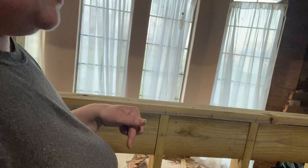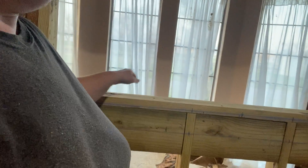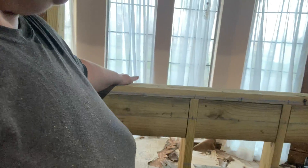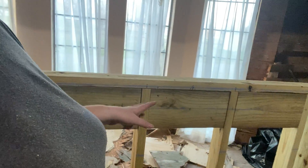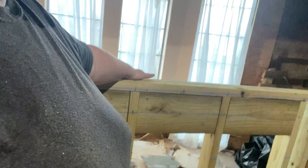As a bonus, I've decided to cover this wall in beadboard, and luckily I had enough laying around to chop it up. This evening's task is priming - I'll go shower and relax a little, but I can prime and watch a movie to get that done so I'm ready to go the next day. You do want to prime your wood at this point. With more modern materials, anything you can do to make them more water resistant is ideal. This is pressure treated, by the way. I really got into it with the chalk lines - these are 16 inches on center per the information they gave me.